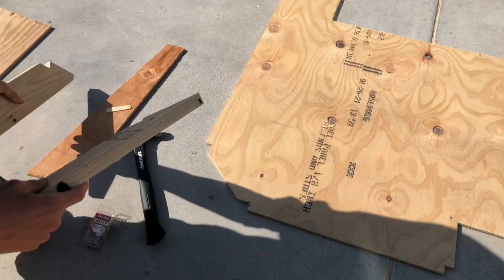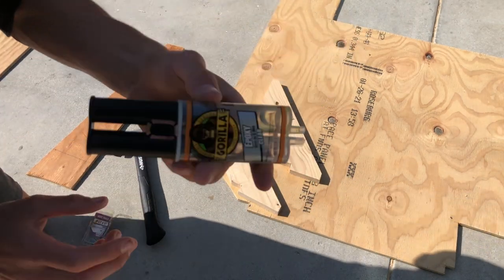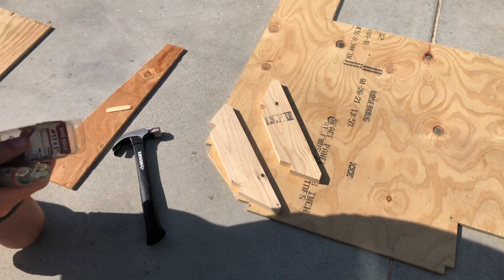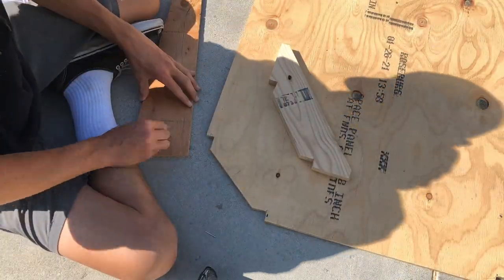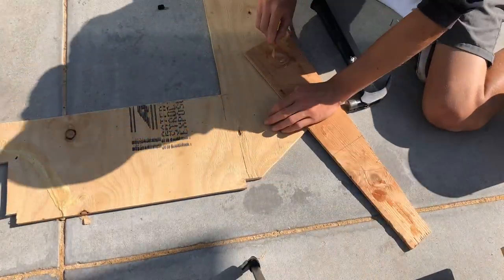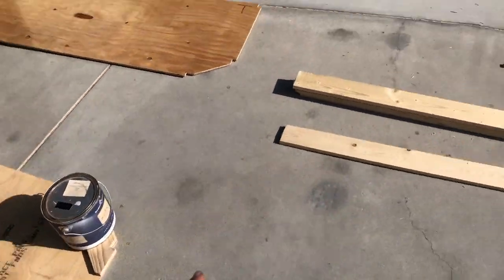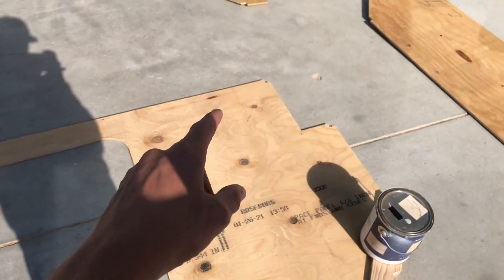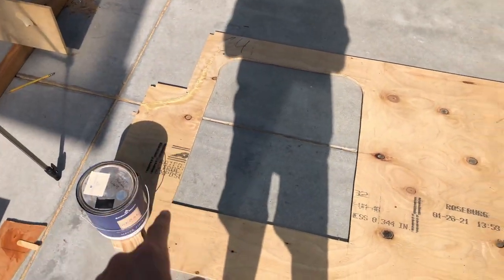Now that I've got each little section cut out, I'm going to glue them with Gorilla epoxy and use some galvanized nails to tack them in place. I have some paint cans to keep them pressed down while they dry. While those are drying, I'm going to take the one-by-fours and cut them into strips to the correct thicknesses for the edges, then measure, nail, and glue those in to finish off the spread.